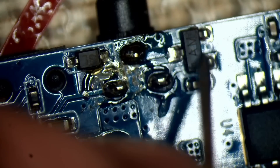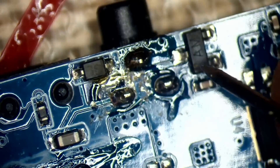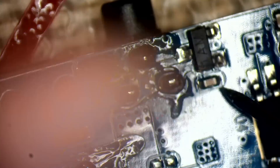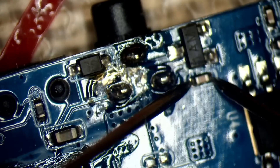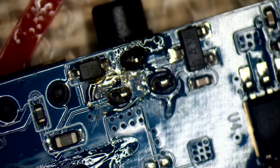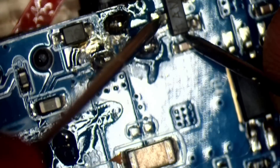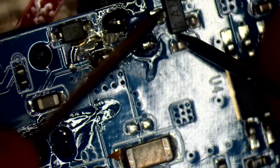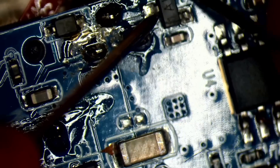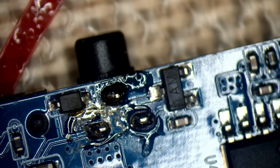Why have we got a short on... point 16. Two of these pads on the transistor — I don't think that's right. Point 16, and we're going to have a short on that cap as well. I assume this is going to be a transistor for five volt because it's right on the power circuit.